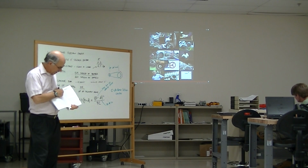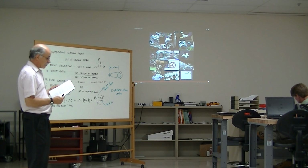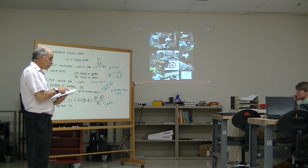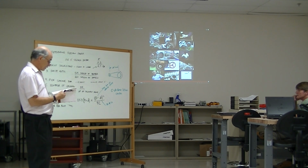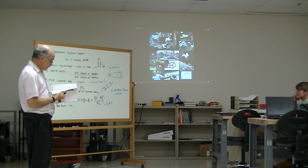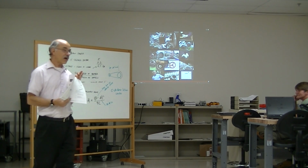And when you get into this, you can see it's very similar to the other chart that we used. You're going to figure out what's the RPM of the smaller sheave, and then you're going to look across and find your drive ratio, and then you're going to go down and it's going to tell you what the correction factor is. You're going to add that factor into this corrected power per belt. And then once you have the corrected power per belt, and still in step 7, you've got to do the loss in arc contact.